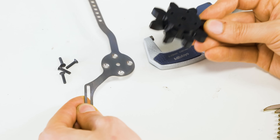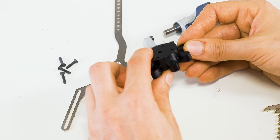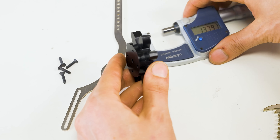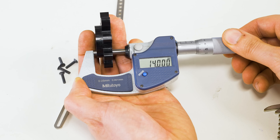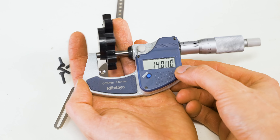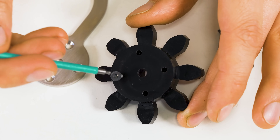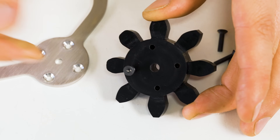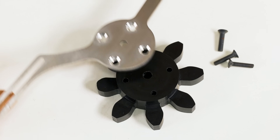Before putting this together I'm going to measure the accuracy of this part. When you're ordering a part, a machinist wants to know the tolerances — that means how much the measurement can be off from the design. I asked Rudy to stay within 0.1 millimeter, so within a tenth of a millimeter. This thickness should be 14mm. This measures down to a thousandth of a millimeter — one thousandth of a millimeter precision. That lives up to my standards, Rudy, thank you. The hole up here is 3mm to give the position for the M3, and lower down it's 2.5mm, which gives a perfect tooth interaction in POM. I tested with my CNC machine and found that 2.5 is the correct size — this is perfect and super rigid.